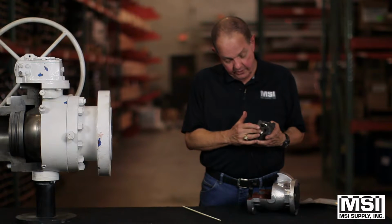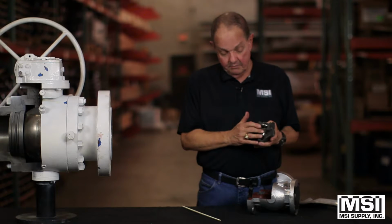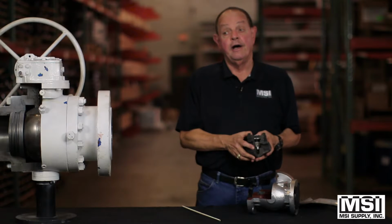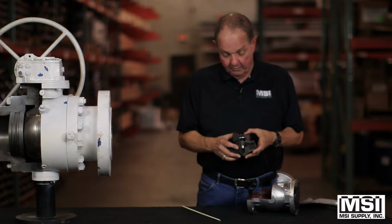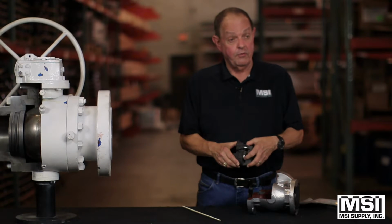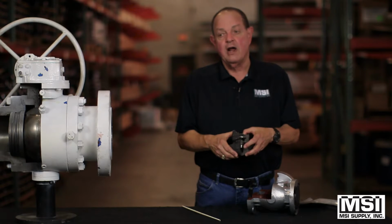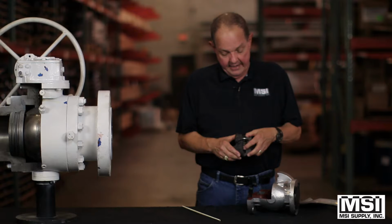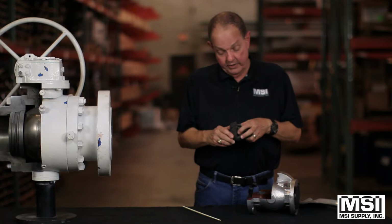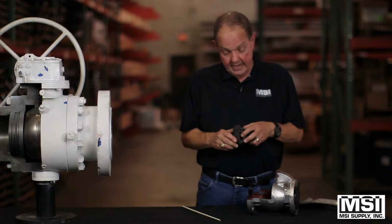This also is a trim 8, 11, 13 chrome with a hard face seat. Again, we can get pretty much any kind of trim you need in these valves. Let's see here. The pressure to open this valve is what they call cracking pressure. It's not something you should be trying to tell us about, really, but it can be important if there's any deviation. If one of your customers were to tell you, I need a certain cracking pressure, please include that in the description.